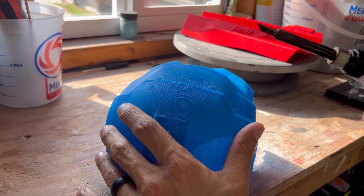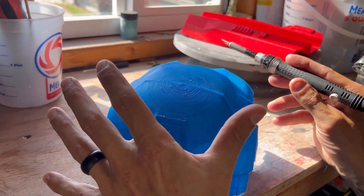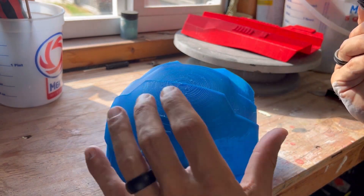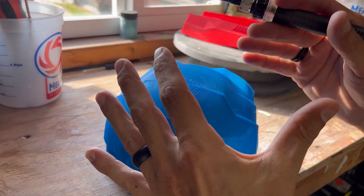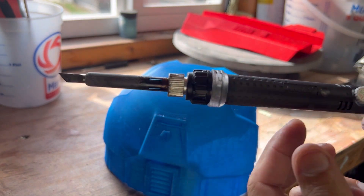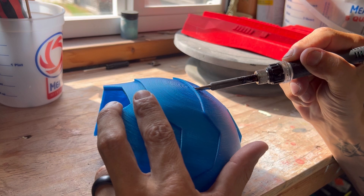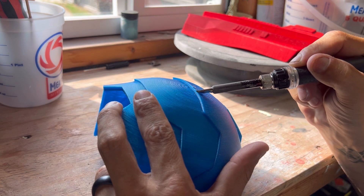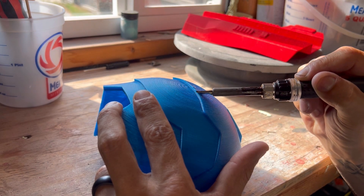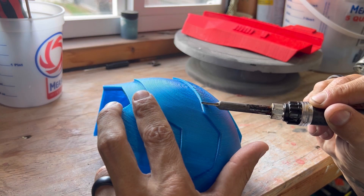I like to use a wedge-style tip here, and whether you're using PLA or PETG you don't want your temperature too high. We don't want to make it so soft that it starts to concave in — we want it just hot enough to where it's softening so we can spread it around. Having a soldering iron with an adjustable temperature setting is definitely going to help you. Very simply, just start dragging this over. You can mess with your temperature settings — this is PETG so it needs a little bit higher temperature. On PLA I keep it around the high 200s to low 300s, and you don't want to keep the soldering iron stationary for too long.